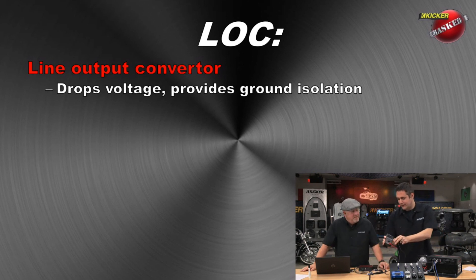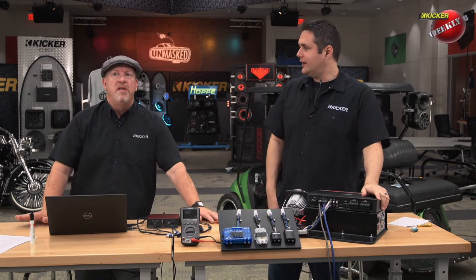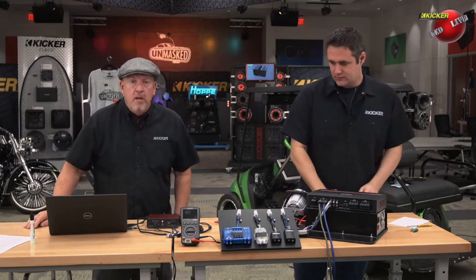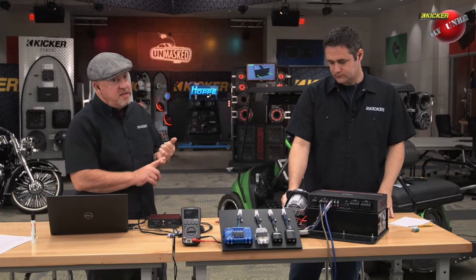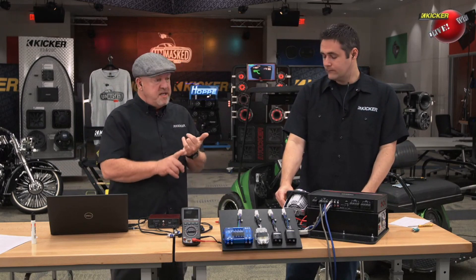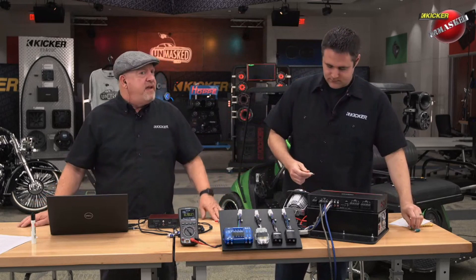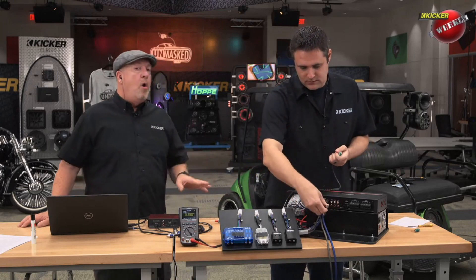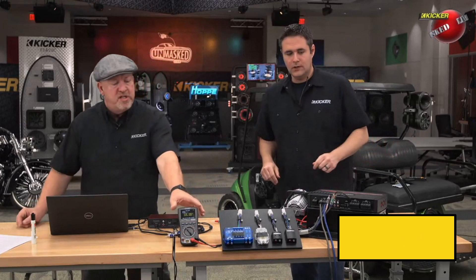Let's show you what the difference in voltage really is. When it comes to test tones, you can go to kicker.com, into the support tab, and download test tones: correlated mono pink noise for 20 to 20kHz frequency response, 50Hz and 1kHz test tones at 0, -5, and -10 dB. You can also get test tones for the Key amplifier, the Key LOC, and the 204. All of that is available online, or through the Kicker app where you can also get box design and more.